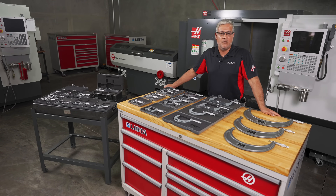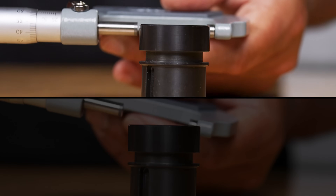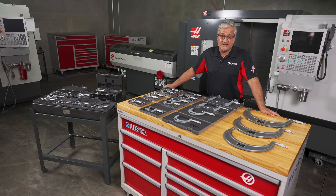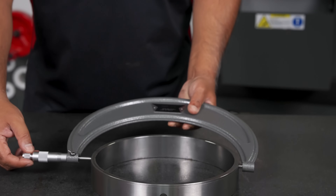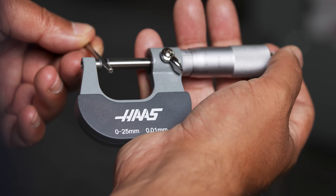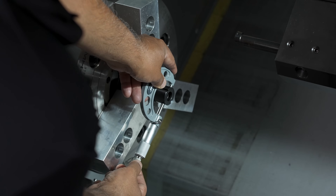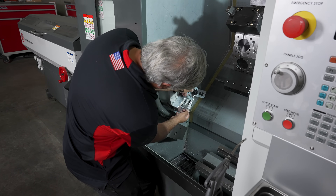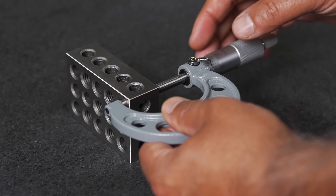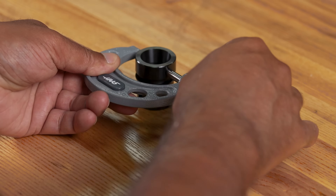Now let's measure the workpiece diameter with the 1 to 2 inch micrometer. The best way to handle the mic is the one that makes it the most comfortable to you, but it is required to place the mic over the measuring surface as perpendicular and square as possible. It's good practice to start with the smallest mic you own, because as the mics get larger so does the difficulty to gauge the correct way to line it up. Although on small mics I usually use the same hand to hold and operate the mic, I don't recommend novice users to do this, and I would also not recommend novice users to use this mic to measure parts inside a machine. I suggest practicing with a small mic and with a part laid vertical so the mic can approach the workpiece horizontally. This places your hands in a natural position without any difficult twisting of the wrist, and the reading is directly in front of you.